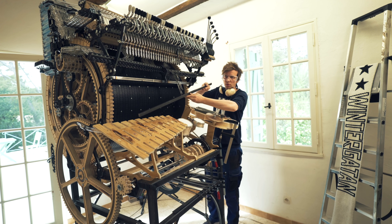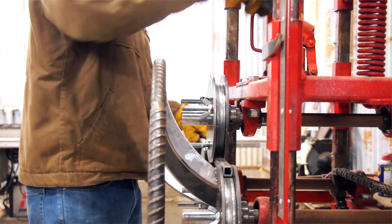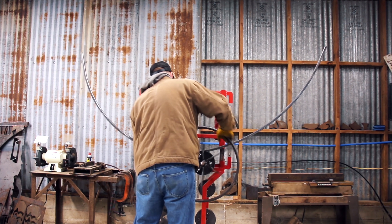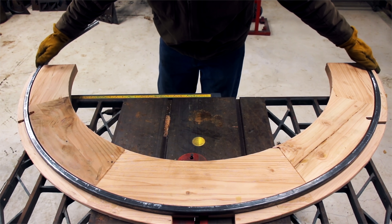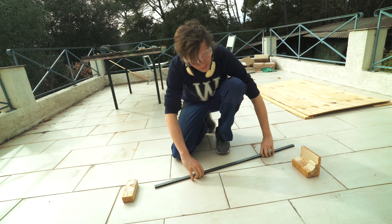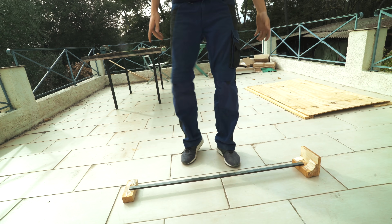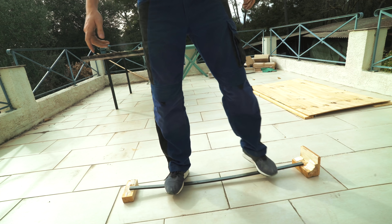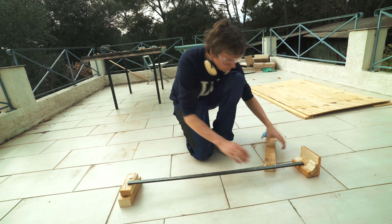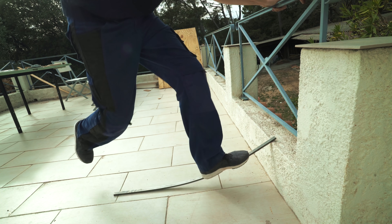It was time to make the front diagonal — it's a kind of an improvisation, it has never been CAD'd properly. First I needed to bend the stock. Here again is the DIY-built ring roller machine that JD built on Rainfall Projects, that he used to bend the square tubing for the back X bracing. To bend the front X bracing I came up with a simplified method: I used a wooden block and a second wooden block placed at a very specific distance away on the ground, and used my feet carefully applying pressure in the middle of the bar. And voilà — you can see we're getting a curve from that stock. By adding some more wooden blocks I built in full adjustability, and look at that curve — it's getting more and more curvy.